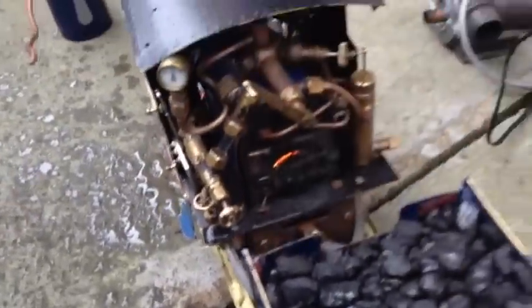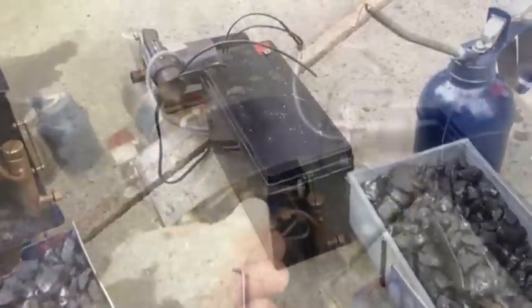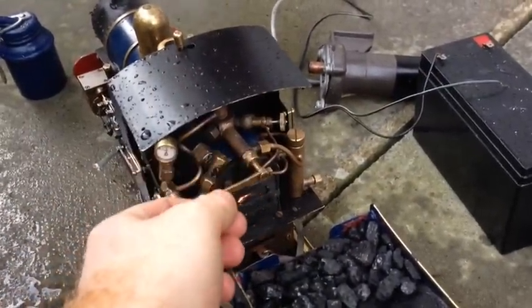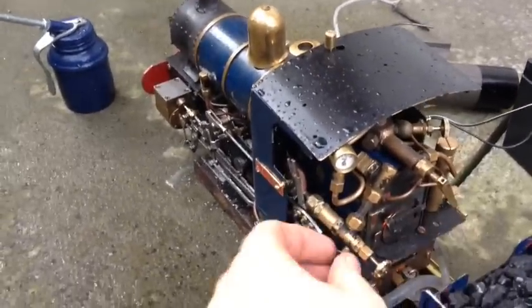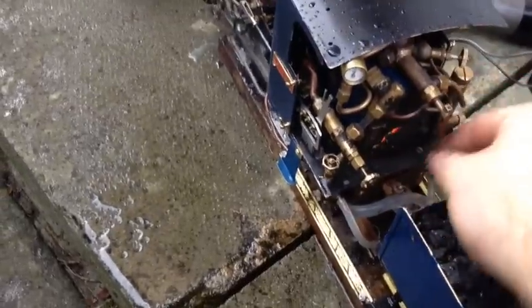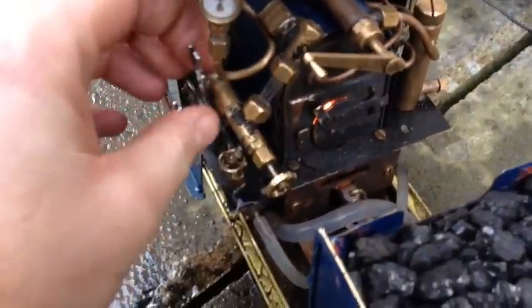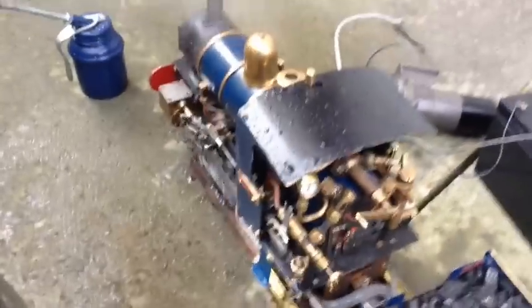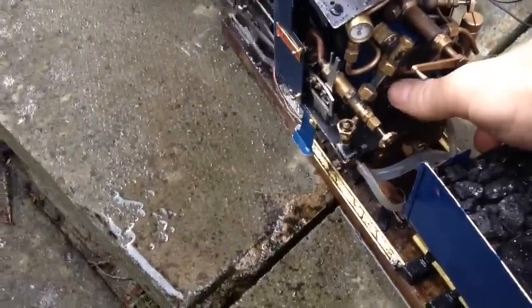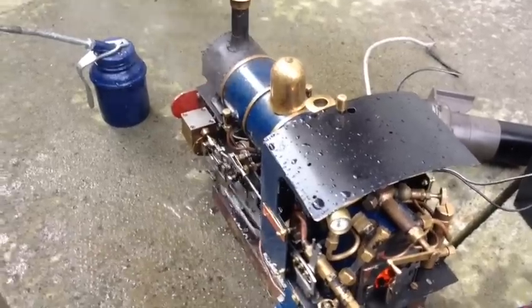Put the blower on now. I'll just keep adding coal until it's established — a bit of steam, a bit of forward. Let's open the regulator. Let's turn the blower off and put on the bypass. It'll just tick away nicely there. Let's open the door a little bit — there's a bit of blowing off, trying to keep it efficient.